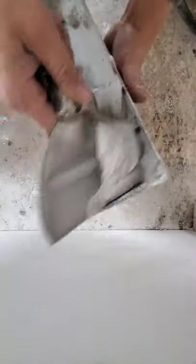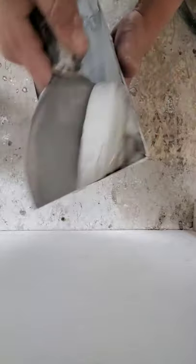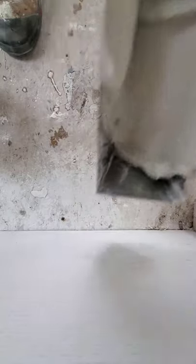Okay, so you want to twist that up. Work it into a nice mud. You try to keep the sides of your pan clean with this stuff, because once it starts to get tacky, it'll contaminate your whole batch of still wet mud. Because the thinner the coat is, the faster it'll dry, right? If the walls of your mud pan are coated with a thin layer, they'll get tacky fast. You don't want that. All right, so there's your mud.